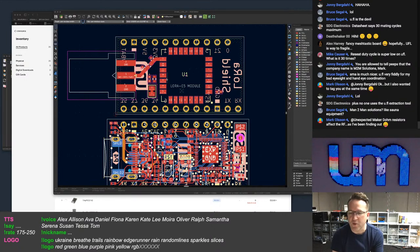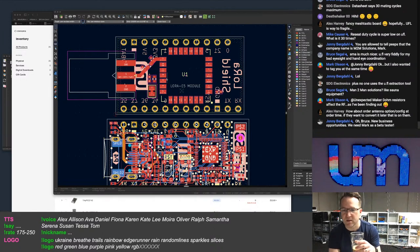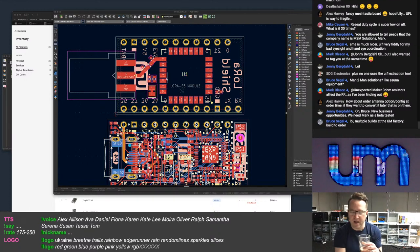And plus there's also the fact that you need to match them with the resistor in place to be able to compensate for that zero ohm resistor. Because there's no such thing as a zero ohm resistor. Like, there's resistance on it. And just the solder, it's not so much the resistance, but just by having the pads and putting the resistor down, you're adding inductance to the board. Like, it affects things a lot.